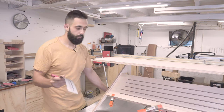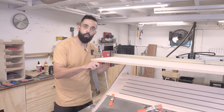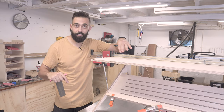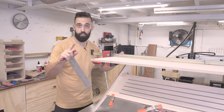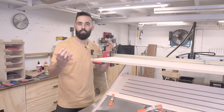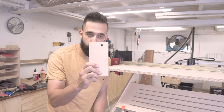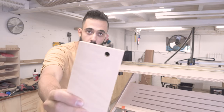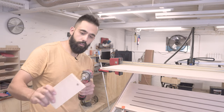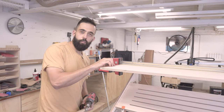Actually, I've got an even better idea. Instead of cutting it now, I'm going to attach the top first and make sure my screws are far enough back so when I chop it with my track saw I can do it in one hit, nice and clean. This is why I like designing on the fly — sometimes what you put on the computer or paper doesn't really capture what your vision was. I was also drilling through a little piece of scrap with a hole the same diameter as my drill bit, so hopefully it reduces the amount of tear-out I get on the finished piece.